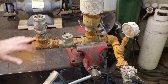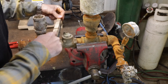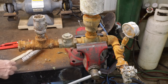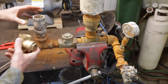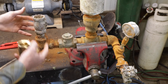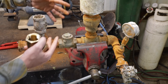If you're just joining us and you're wondering what you're looking at here, this is a ram pump — a very, very old pump designed by some smarty three or four hundred years ago that gives you the ability to move and lift water with no electricity, just with two moving parts. And those parts are the check valves. We've got one right here and one right here. This is the waste valve, and I forget what this other one is called, but there's nothing to it — it's just these two pieces. I know it's confusing. A lot of folks ask me to explain it. I will explain it when we hook it up — it'll make it much clearer.